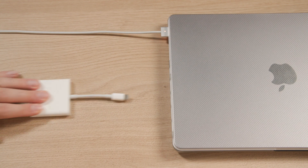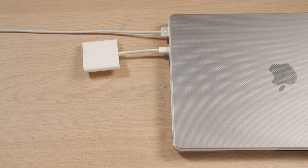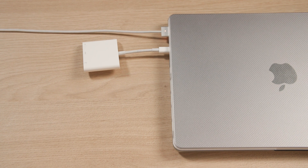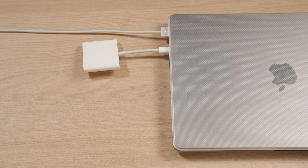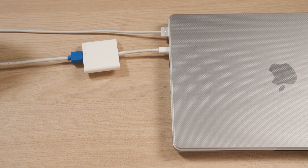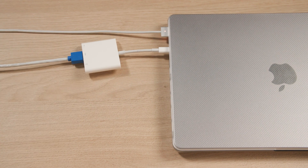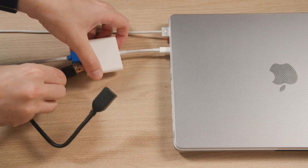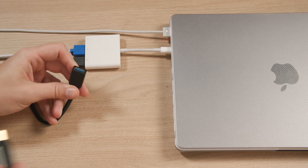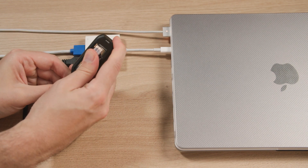On the live stream side, we'll use the MacBook Pro, and I'll start by connecting a Cam Link 4K. Since my MacBook has all USB-C ports, I'm using Apple's USB-C adapter. This adapter allows for one USB-C port to provide power for the computer, HDMI output, and USB Type-A input. We'll plug in the power cable, then an HDMI output cable, and finally the Cam Link 4K. You may want to use the included USB extender that came with the Cam Link, since it won't fit side-by-side with the HDMI cable. You are now set to output HDMI from your computer to your ATEM and input any HDMI camera feed into your computer.